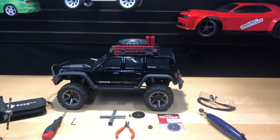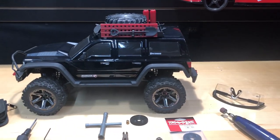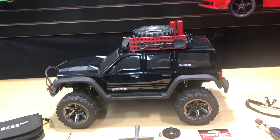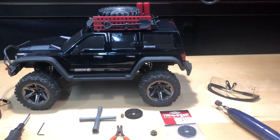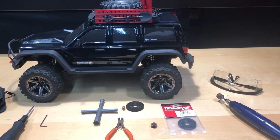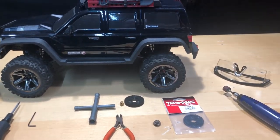What I'm doing here is I'm going to change the gear ratio on this thing. We're going to lose the torque but we're going to gain the top end speed. So if you're looking just to make it faster and you're not really rock crawling anymore, then this will be good for you potentially. I'll show it in a video as far as the speed it is able to achieve now that it has this different gearing in it, but it won't be in this video so just stay tuned for that one.